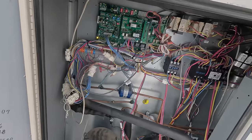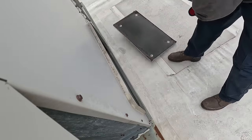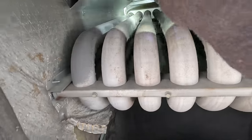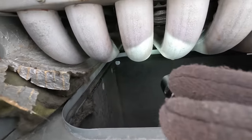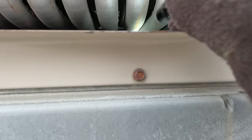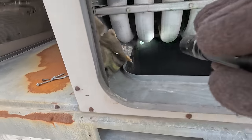Right now we're under just the G call. Let's go ahead and look at the heat exchanger real quick. Let's get a good peek on this — also gives us a chance to look down there and see if it has any open areas, which everything looks to be open. Looking at the heat exchanger, it must have been replaced at least once or two or three times. Looking at the bottom, you got a little bit on the seam there — I see a little bit of seamage starting to rust. Nothing split open, but you can see moisture starting to come through on some of the seams. I'm going to note that it's got to be watched.